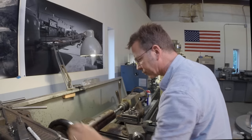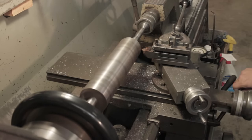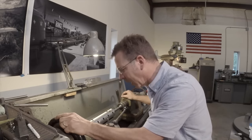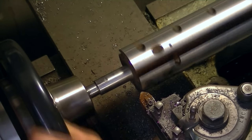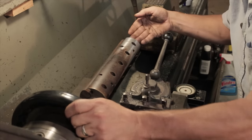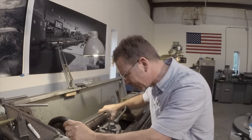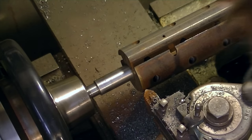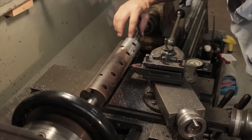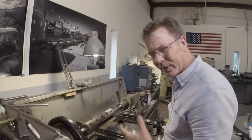I'm feeling really confident. I think we're going to go in ten thousandths on this one. Well, I have to say we're cleaning up really well. You can see this edge here has got a pretty tough burr on it — this one here has completely been cut. You can see how out of round it is in this section. Also at this end, I never noticed that before. We've gotten some cutting here but I don't have much to go in. I'm going to zero the gauge out and bring it in and see when it cuts. Okay, about fifteen thousandths more. I'm getting still a pretty rough finish. I'm feeding it at a pretty quick rate — I don't think I'll take the risk and cut the full fifteen yet.